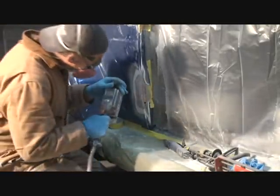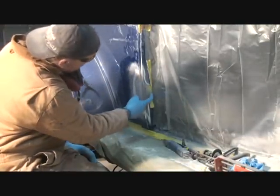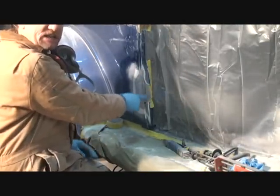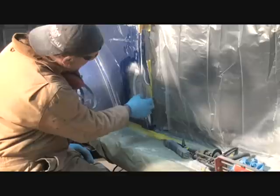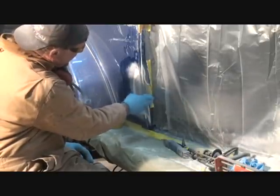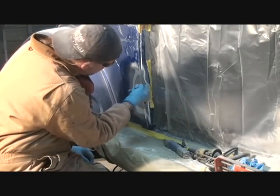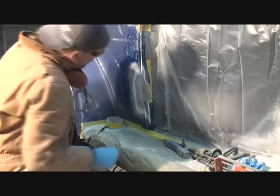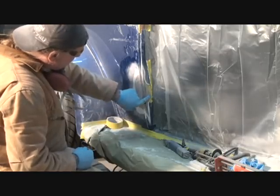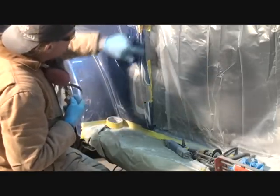I'll go ahead and get the inside here. If you notice, I haven't taken my tape off right here — the reason for that is I want that fiberglass that I built up on the tape, I want that to stay on there so this piece won't break out of there. Now once I get that built up, I'll take my saw and I'll cut that out — and so that tape is actually helping me hold all that in, having that tape on there with the resin on top of it.